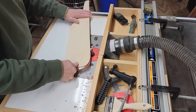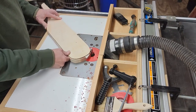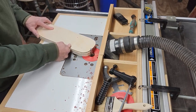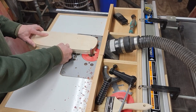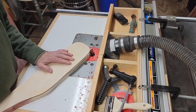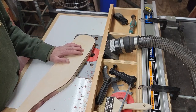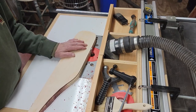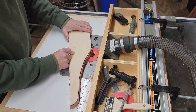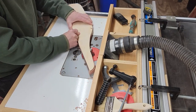You want to be very careful using a bit like this. The bit is very unforgiving, and trimming a wood like cedar, which has a tendency to splinter, can be difficult. Although I showed the two-faced tape with one of the feet, I did not trim those on the router table. I did those on an oscillating sander. Those are all end grain, and the cedar tends to chip out on the end grain fairly easily. I'll also put a link up above to the two-stage dust collection system that I built for my small shop.